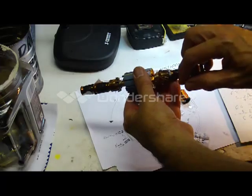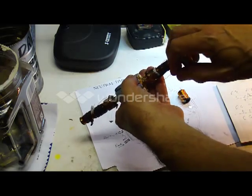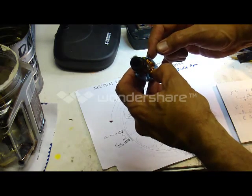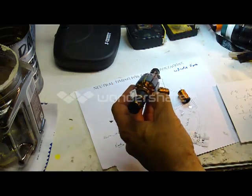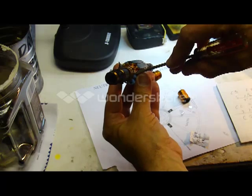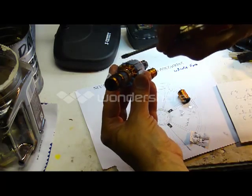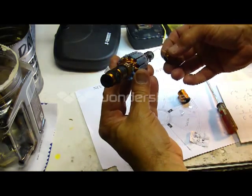I've finished winding an additional number six coil here, south coil, to prepare the way for another addition on finishing coil number two, combined with poles four and five for the north coil. You can see the bent Y configuration on the first pole. I come out of here on the south half coil, and come around here and finish the north coil here, so you can see the bent Y of the quad pentagon ten pole wiring pattern.